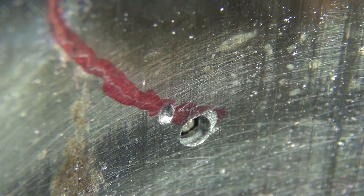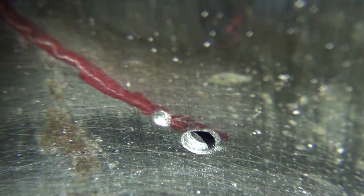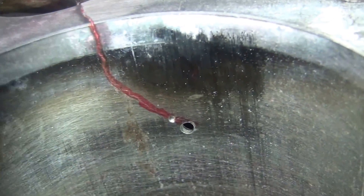You can see how thin this hole is — I was figuring it's going to be about 3/16" thick, but you can see back in there some kind of a cavity. I'm not sure if we're even an eighth inch thick in there, it's pretty thin. So I'm going to have to use a different style pin than I was thinking. You can see where the crack kind of comes in above it there, so the next hole is going to be slightly above this hole. We'll tap this and continue on trying to pin this thing.